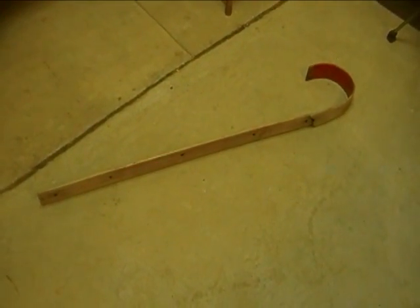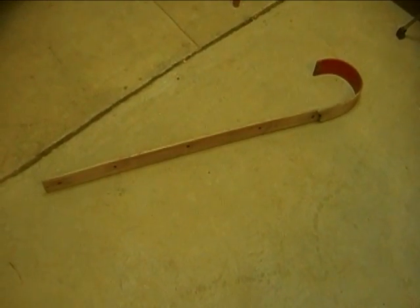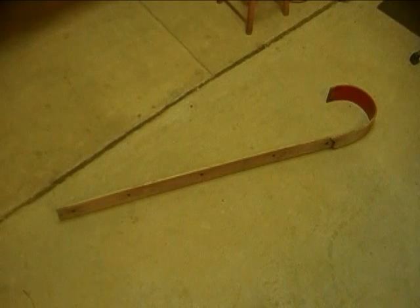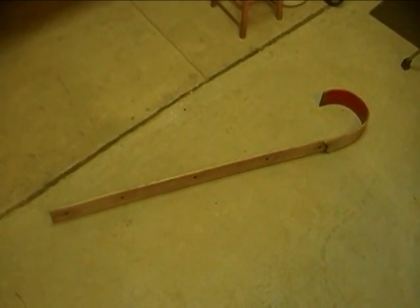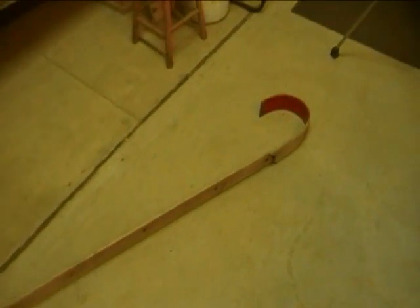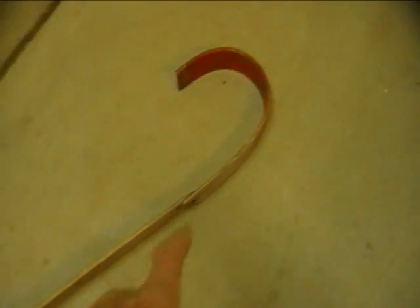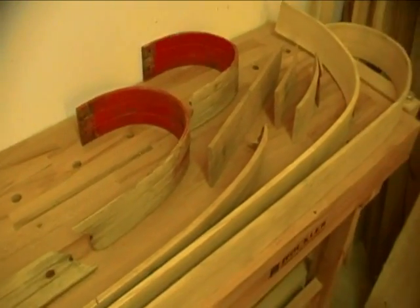So I'm trying to replace these 2 skis, which came off of a small wood hauling sled that a guy's wife's father or grandfather made many years ago. The material is 2 3/4 inches wide and about 340 thousandths thick. That's about a 32nd less than 3/8 of an inch thick. The guy brought me a whole ski, which I broke right there, and he brought me just the broken off end. Here we're going to look at various failures.